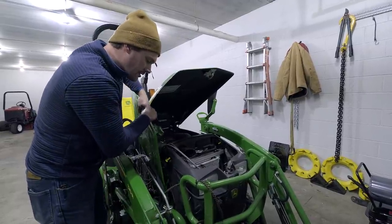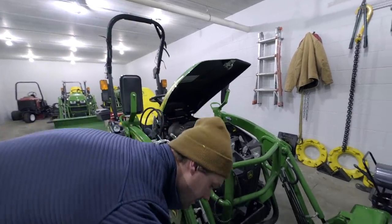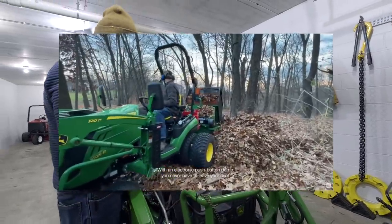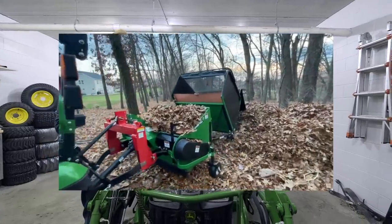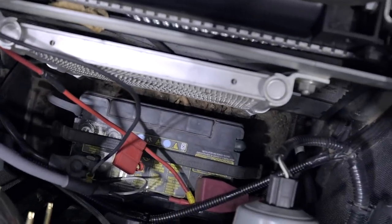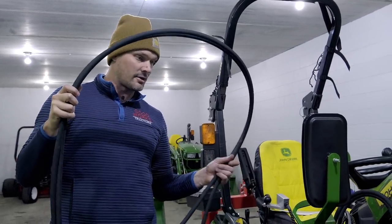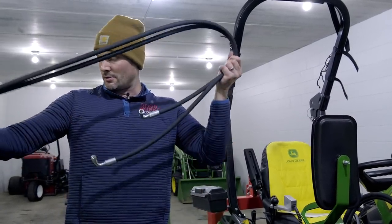For the record, after we do a future video with different grapple options, I'm going to be taking the electrical wiring harness out. This gray cable is for the Sweepall Sweepster — it has an electric dump option, so that's what this is for. I may keep it on or take it off — they just both tie into the battery terminals, no big deal. Now it's time to put the longest set of hoses on, running from the diverter valve down the loader arm and mounted on the front middle rail of the loader assembly.